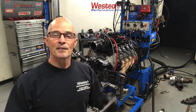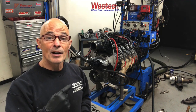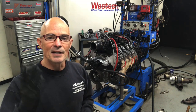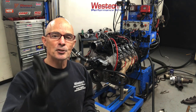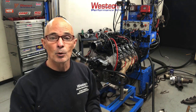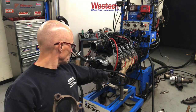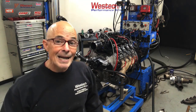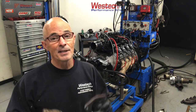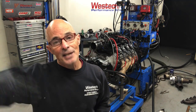Here's an important tip when you're going to get the flanges from the wrecking yard - there are actually a couple of different kinds. One style is kind of flat with a built-in O-ring receiver groove. Make sure you match the right exhaust manifold with that flange. If you're getting them all together that's going to work out fine. The other style comes with a flare on it and a special gasket that you've got to use. Both can be used on the same manifold, but also remember there is a right and left side manifold and a right and left side flange - the flanges are different. One's kind of longer, one's more triangular. Make sure to match the right one with the right manifold when you're doing your turbo kit.